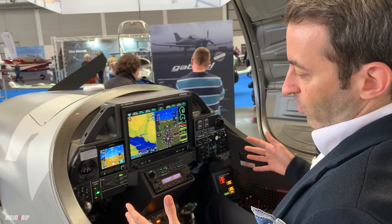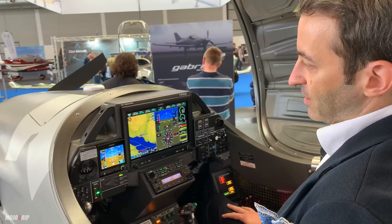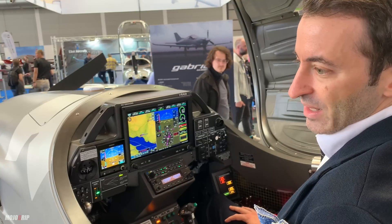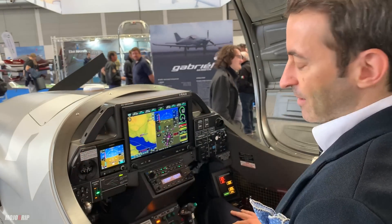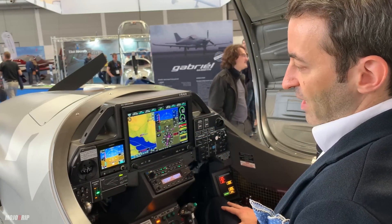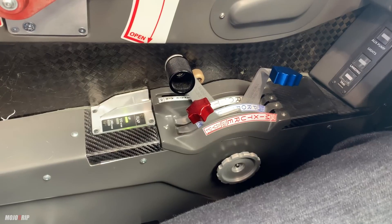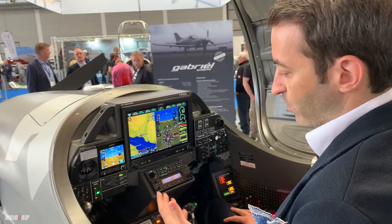This is the inside of the BK160-TR. We have two identical cockpits. The human-machine interface is designed to give very good visibility — we have a bubble canopy. If you've never experienced flying in a military aircraft, the visibility is completely different; the awareness you have is totally different. Inside, you have a large air display where all the avionics is Garmin, with backup instruments, communications, engine and fuel management, and lights on the right. You have all the throttle and aircraft configuration controls — flaps, landing gear. This is, of course, a retractable undercarriage and variable-pitch propeller aircraft.